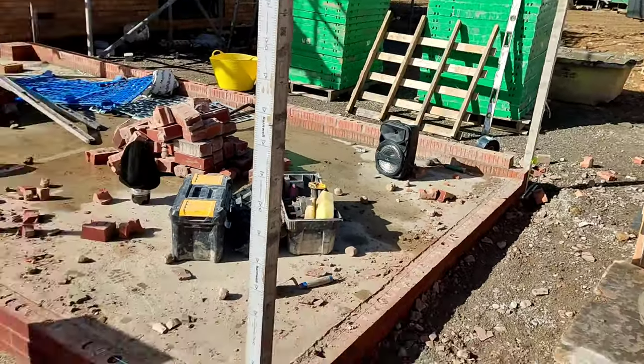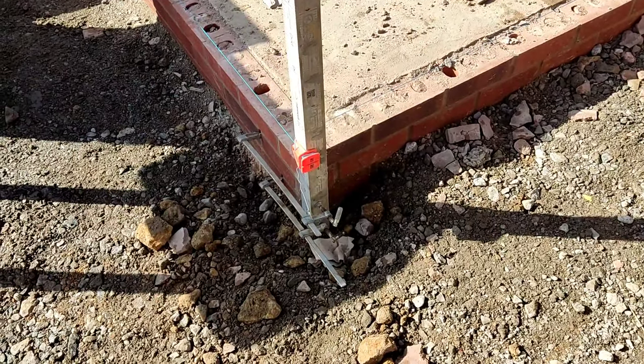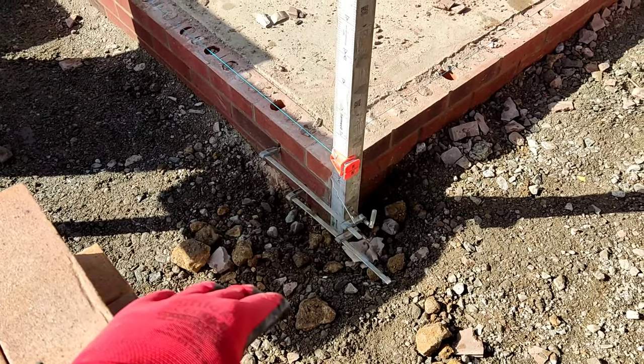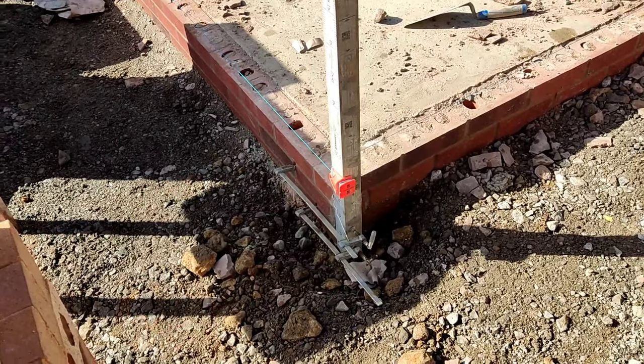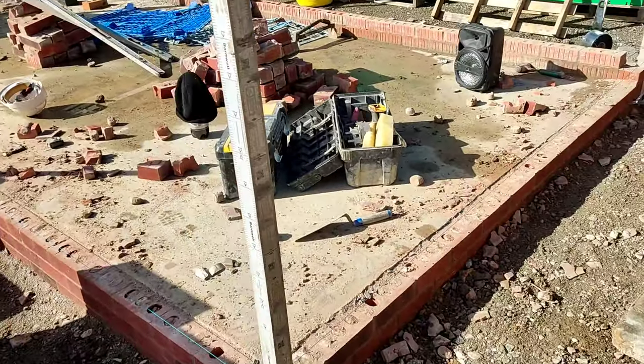So I didn't film anything Friday, but here's a bit of footage from this garage we did on Saturday. It's Saturday. Probably the best setup I've had for a garage in a long time. Check it out. One profile, two profile, three. When you've got a stabiliser, a little tie wire to level them up, and just tighten your clamps extra tight, get them deep into them joints. That pretty much holds them up till about 10.